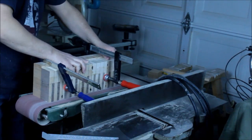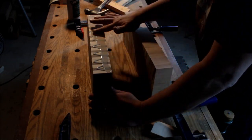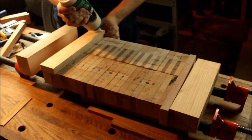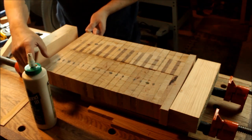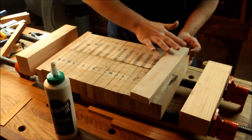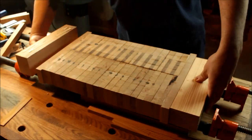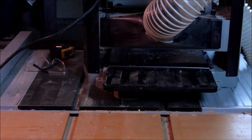The pieces will be clamped together as you can see, and then I can do the glue-up for those sections. The next glue-up involves another cherry board I made just for the ends — I'll be gluing those end caps, which are laminated strips planed down. The two blocks at the very ends are glued on temporarily just for the planer; they take care of snipe and also prevent chip-out on the end grain.